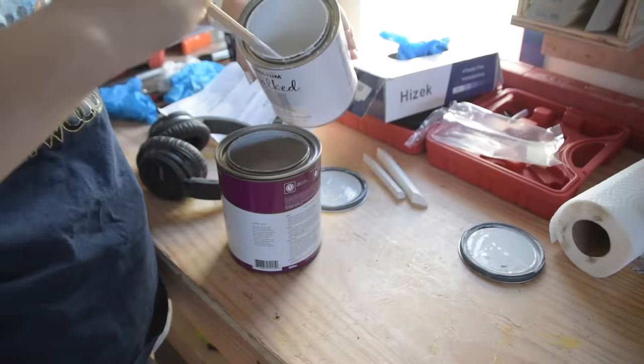So I went to the manufacturer's website and they recommended getting a hairdryer, warming up the corners that are lifting so it's nice and hot to the touch, and then placing heavy objects on top of it overnight. And I can tell you guys with certainty that this trick works. It fixed all of the lifting corners. The only thing is now I'm a little worried that it's really, really stuck to the floor and it's gonna be kind of difficult to take off when we move out. But that's a problem for future Allison.